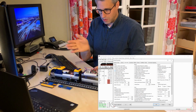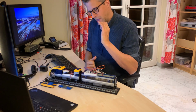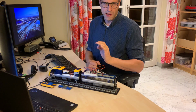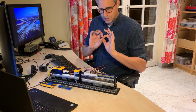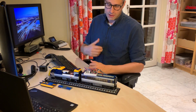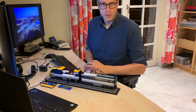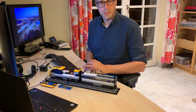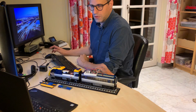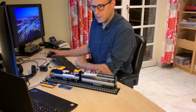If the train is going the wrong way, for example, the switch didn't work properly, and the train is hitting a sensor where it is not expected to be, then the block will turn into a ghosted block. A ghost train is on the block. And when we set this setting here, the emergency brake is pulled and all trains are going to stop. So that's pretty handy if you want to avoid a mass carambolage on your layout.